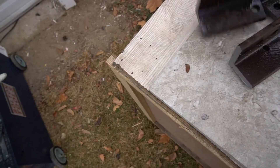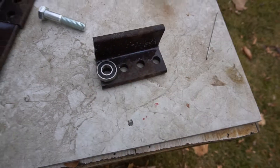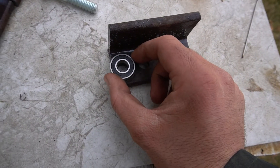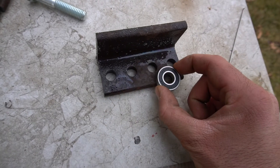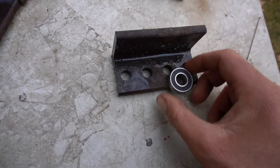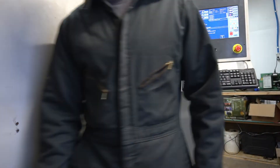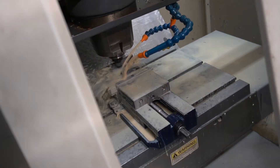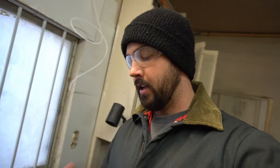So we have an issue. The mounting holes are going to be way higher than where the bearing would be touching the ground, so in order for this to work as a wheel it needs to be down low. I'm going to put it in the mill and cut two little holes so the bolts can hold on to this — that'll solve our problem. We've got our last piece ready, pulled out of the machine. Now I need to run to Lowe's and grab a couple more half-inch bolts, some lock washers, and lock nuts.